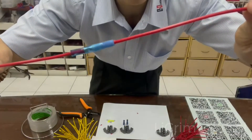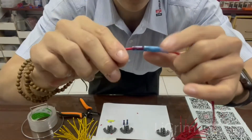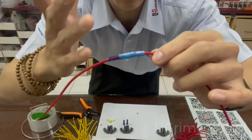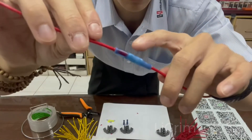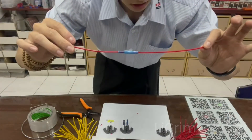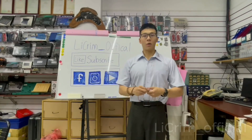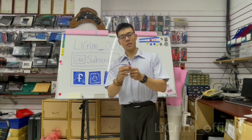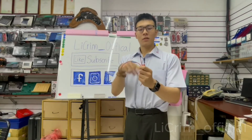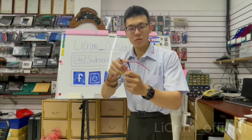We're done, but you need to give it a little time to cool down — that's why you can still see the wire inside. After a few minutes, it will look like the other side and turn blue. You can see it starting to get blue. That is what the A dies are for. The A dies are the heat shrink boot connector. Here is the result of today's crimping: A, A1, A2, and A3.